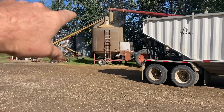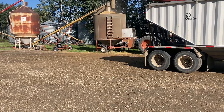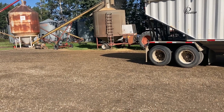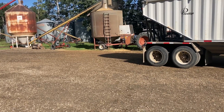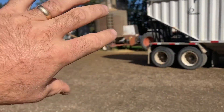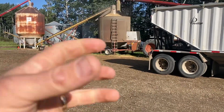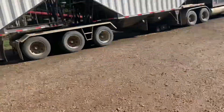It's not full of oats right now and I'll show you when it's empty. Inside there's another big screen cone, so the grain is only maybe 12 to 15 inches deep going around the walls and down the sides. That big fan pushes hot air in there — the idea is you heat the grain up and the moisture comes out through the screen. This is inside the dryer. As you can see, between the inside screen and the outside screen there isn't a whole bunch of space, and that's how it works.